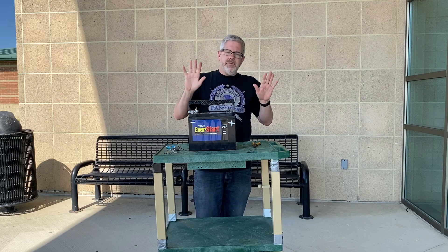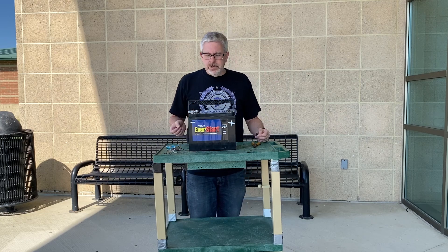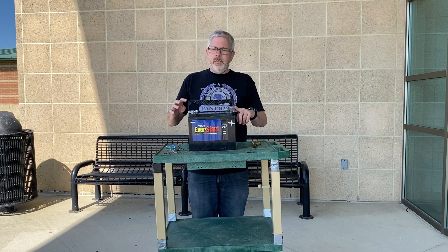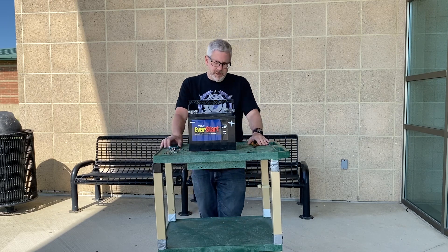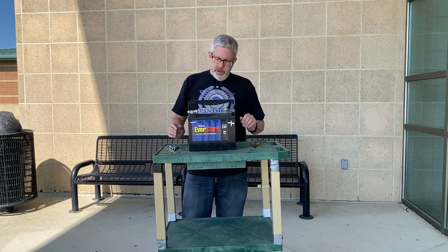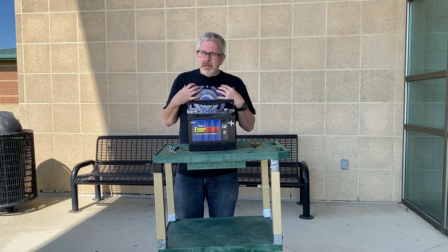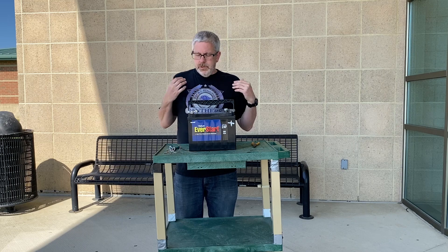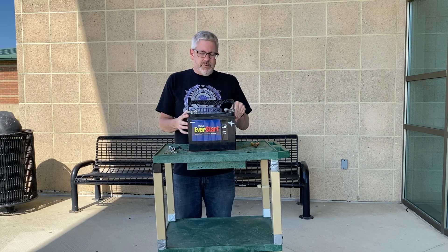But human skin on average has a high resistance. Let's say I have a hundred thousand ohms of resistance — 12 volts divided by a hundred thousand ohms would be 0.000012 amps. Might be off by a decimal there, but that's not enough to hurt me. There is electricity going through me, but not enough to hurt. Hopefully that makes sense — and that's a good dramatic explanation of Ohm's Law.